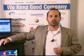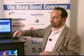Now what I want to show you is an example of what happens with a line interactive UPS. Have you ever been sitting at your desk and noticed that the keyboard will lock up, it's not functioning, it's not responding, or you've seen that your lights have dimmed? That's a situation where you've had a brownout. It's where the voltage has dipped to an unsafe level.